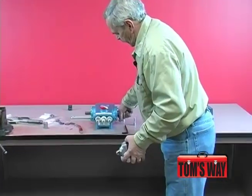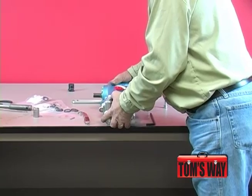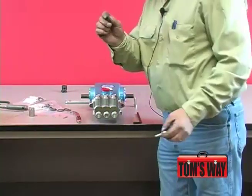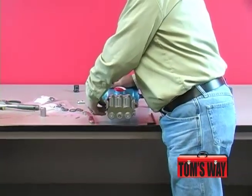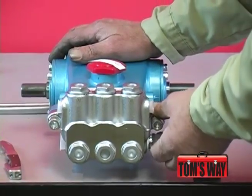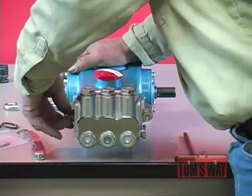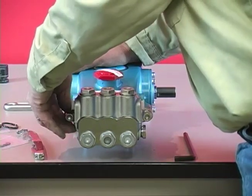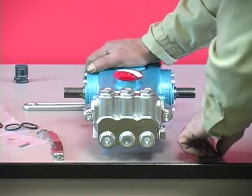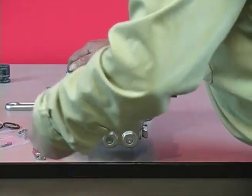What I like to do is put the two outside ceramics out — it gives you more of a guide to put it together. Get the head started and push — they push on hard. Once you have it in, insert your bolts and tighten it up the rest of the way. When you tighten the head back on a pump, you do not tighten one side straight down — alternate between sides. The reason is you do not want to pull one side of the head down and have the other side a quarter inch out, because then you're either going to pinch the seals and ruin them, or crack a ceramic. So you snug one side down a little bit, then go to the other side and snug it down a little bit.